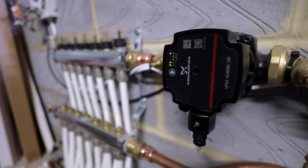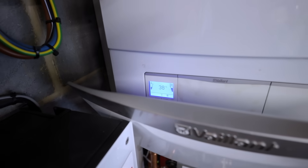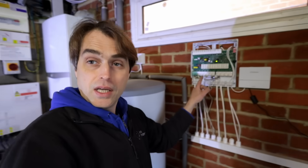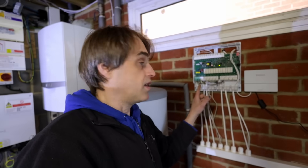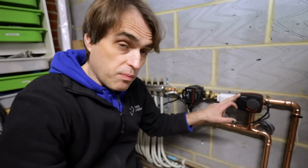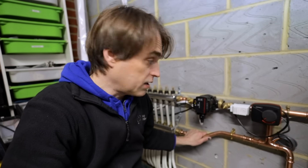The system is now finished and running. We have brought this boiler back into the 21st century and it's running beautifully — weather compensated at 38 degrees right now. It's running low, it's running weather compensated. Everything is now controlled by the VR71 Vaillant wiring center. So if you have a Vaillant boiler and cylinder, this is what you should be using. The underfloor heating is running as well, pump running, SB blending valve fully open because the boiler is running at low-30-something degrees — that's all the underfloor heating needs right now.